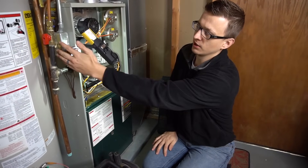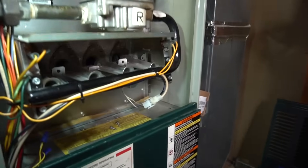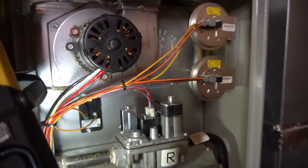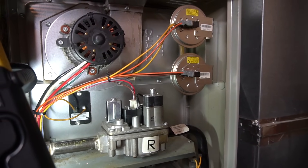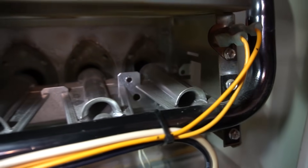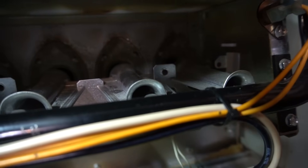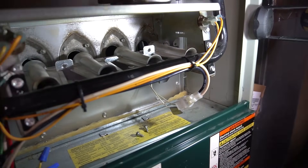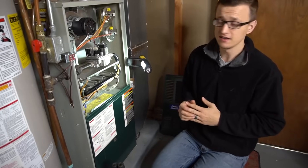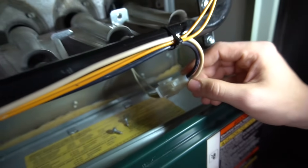Before we get into how to check it, let's see what it would look like if your igniter is burnt out or not getting power. I turn the power back on to my furnace. The very first thing that should come on is the inducer motor if there's a call for heat — and there it goes. In about 5 to 10 seconds the igniter should start to glow, but as you can see mine is not glowing. Then you're going to hear the gas valve open up — you should hear a click. I can actually hear the gas hissing out and nothing happens. That's what a typical burnt-out igniter scenario looks like. My igniter is not actually bad — I just left it unplugged slightly to simulate a bad igniter so you could see what it looks like.